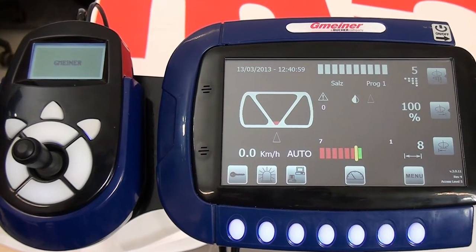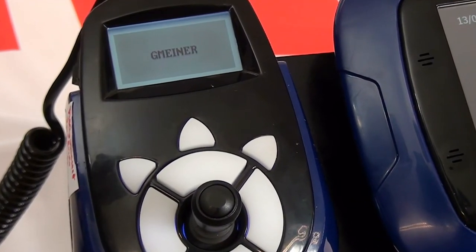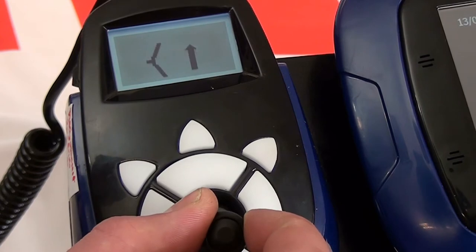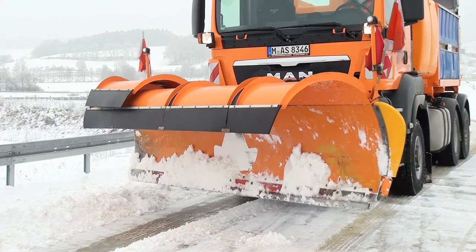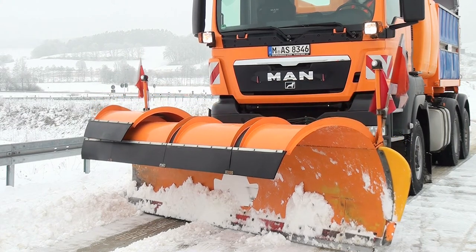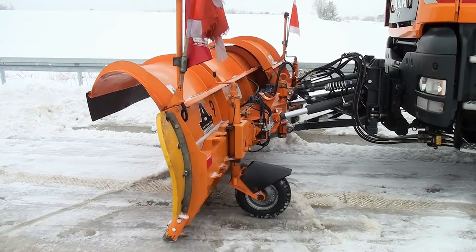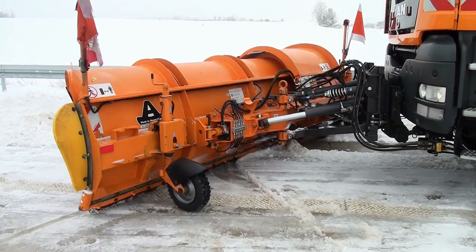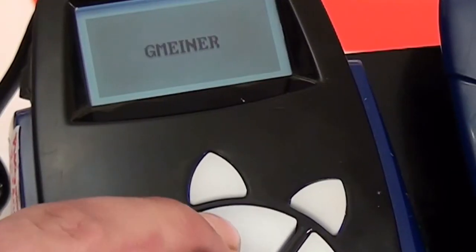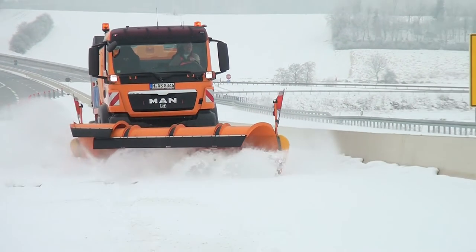The snowplow operating port EASYCON extends the operation range of the ECON ideally. The operations lifting and lowering as well as swiveling the plow can be controlled with the joystick. The plow relief in percent as well as the floating position are activated with the additional push buttons.